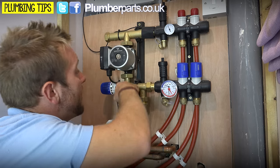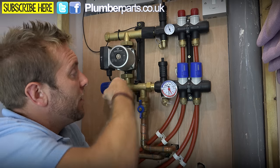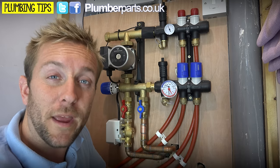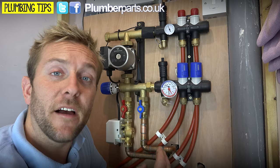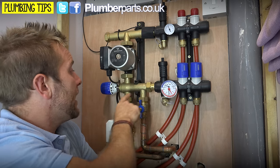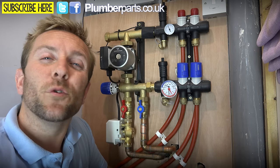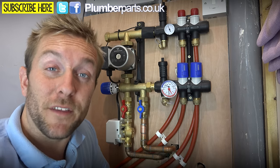So this hot water then will be sucked through here, and then this pump basically circulates around and around this area here like so. Now, as we said earlier on, different floor makes need different types of temperature. So low build wet-in underfloor heating, which is used a lot for, say, timber floors, requires a slightly higher amount of heat going through those pipes. And what we can do is set the heat going through the underfloor heating using this here, which looks very similar to a radiator TRV. Now, because what we've got here is a 75mm screed, screeded floors don't need to be as hot as other floors. I mean, most people run them at 45 degrees, but I'm going to run this at 50 degrees.